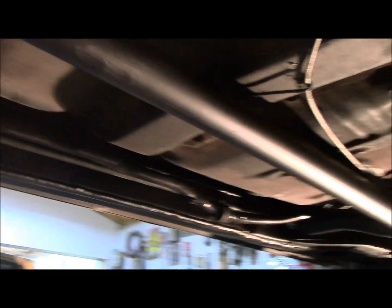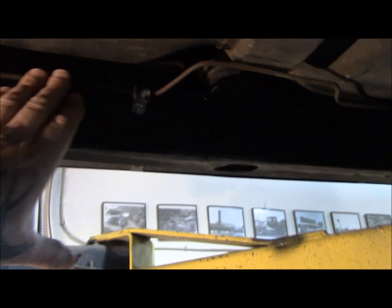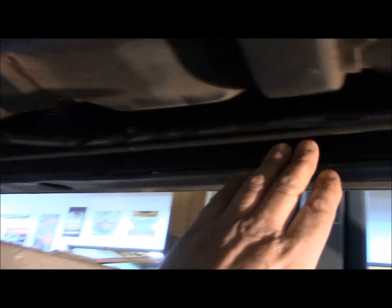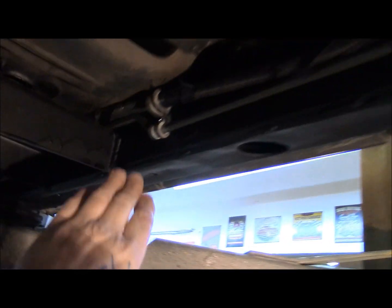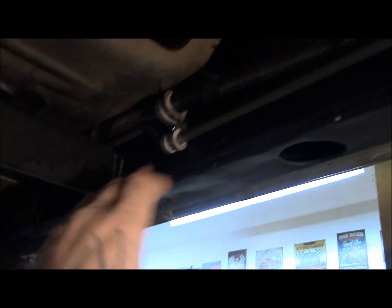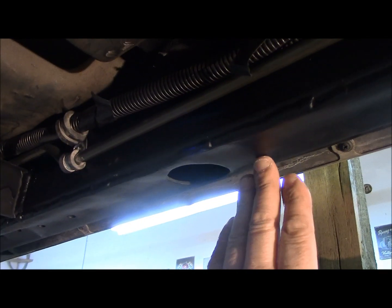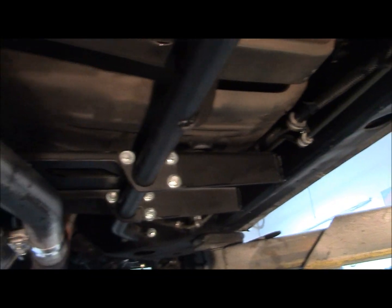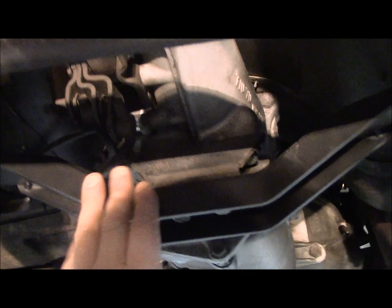So anyway, this is it. It's all in place, as you can see. Everything is done. It fits nicely. We've got our exhaust back in. We've got our drive shaft back in, thanks to Chris — Chris took care of all that. The brake line was perfect; you did not have to alter the brake line on this car. It fit around everything fine, the e-brake cables fit around everything fine. We did have to change the fuel line, only because these are welding here. And don't forget, all these lines were tucked inside because this was never boxed, so we had to alter the fuel line. You've got your crossmember here that drops out for your transmission. So it was a very nice kit, worked out handy.